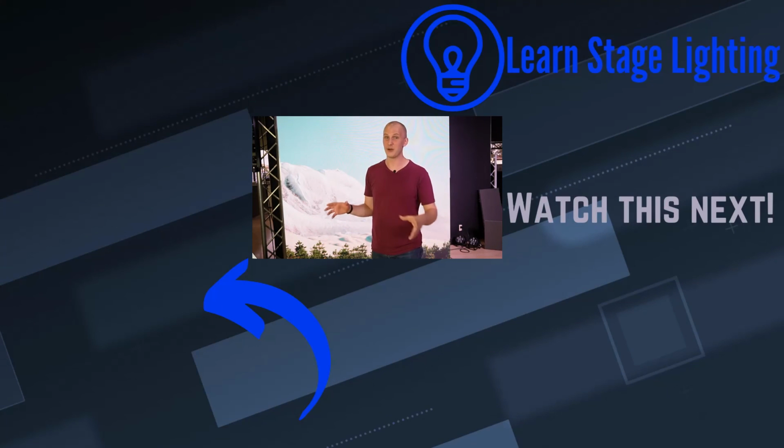I hope you enjoyed this journey looking at what you gotta know to design an LED wall. If you do go with us, we're gonna do a lot of the heavy lifting on pretty much all of those specs. You've just gotta think about really the size you want, and we'll talk to you about pixel pitch and figure out, okay, is a 3.9 gonna be good, or do you need to go to a 2.9 or 2.6 or a 1.8? Probably not, but you never know, depends what you're doing.